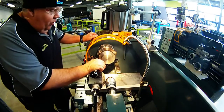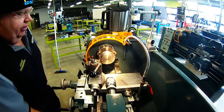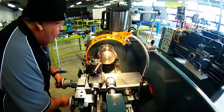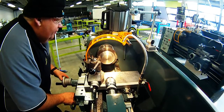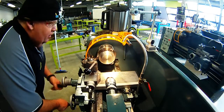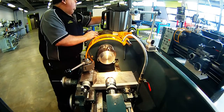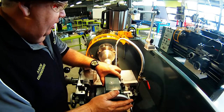I've got it down to the diameter that I want. I'm just going to offset the tool post down and break this sharp edge on the job. We'll just take off that sharp edge, making sure we don't hit the chuck jaws. Now we're just going to run the center drill through the job — I think it's a number six in there.